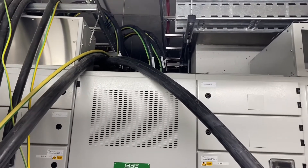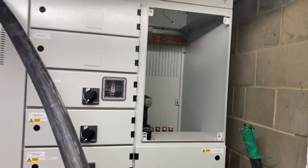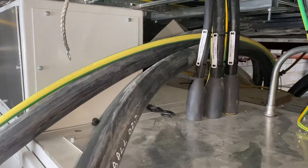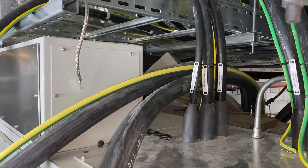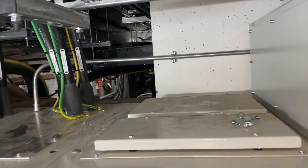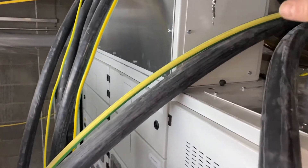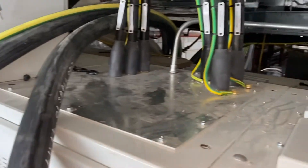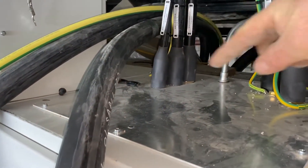Welcome back to another exciting day at the coalface. Those two cables have got to go into the side of there and then down onto those coppers. What we've got is three cables there - four core 25s - and I've got to bend round them into there. We'll have to change the orientation as they come round, with one going on the bottom and one going on the top, so I can bring them right to the front and in. This way it still leaves plenty of the gland plate free for other people to use.